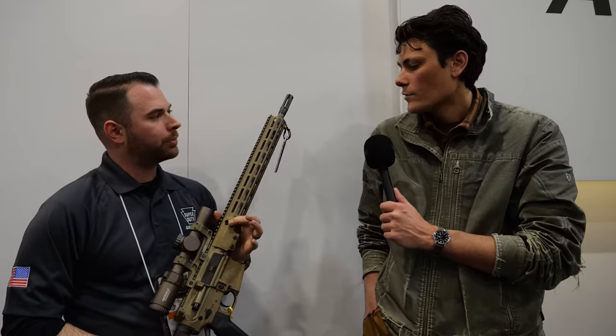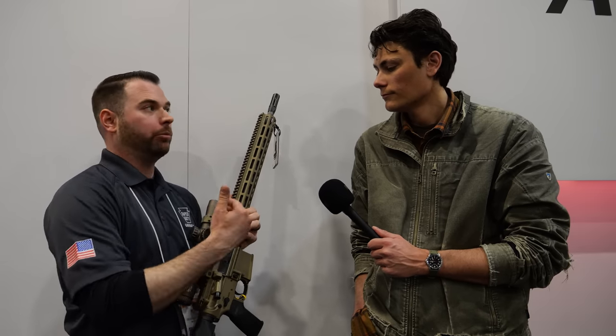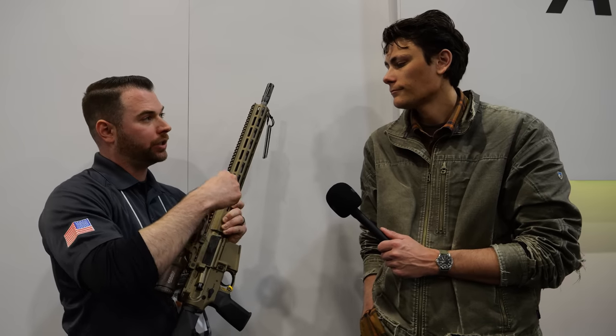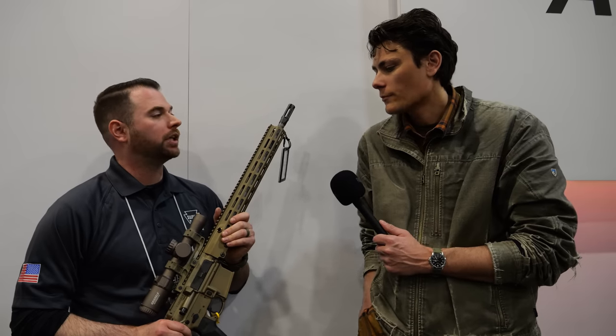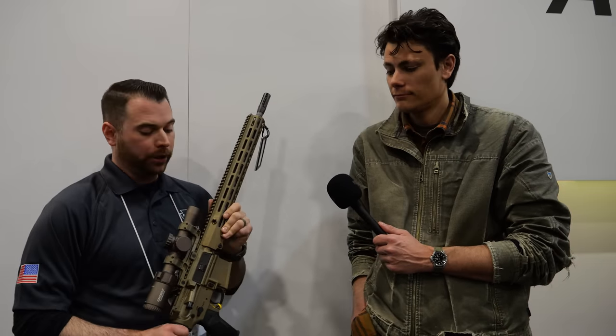We get asked a lot about this — the handguard has a steel reinforcement. A lot of people think it's brass or copper, but it's heat-treated steel. This is something we've had for a while in some of our handguard contracts. It reinforces that point, and if you're running our rails with a thicker barrel, there can be standoff issues with the QDC not going down far enough — this eliminates that problem. Steel-on-steel contact instead of steel-on-aluminum, similar to the upper receiver reinforcement. Just product improvements to maintain our Super Duty reputation.